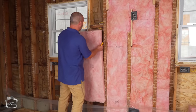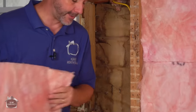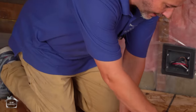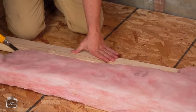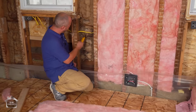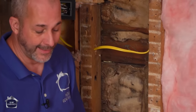The key to successful installation is very similar to soundproofing — if you have an entire wall soundproofed but you have one hole, you hear the sound clear as day. It's the same with insulation: if you have one weakness, that's where the cold draft comes from. Having a weakness in your system means a huge energy cost trying to heat, you'll have drafts, and most importantly with those drafts you'll have hot and cold air mixing, which causes rot and mold. The wood gets wet, the paper stays wet, it doesn't get a chance to dry — and that's going to be a problem.